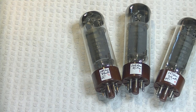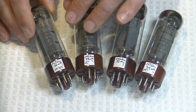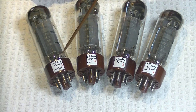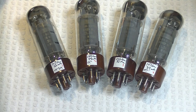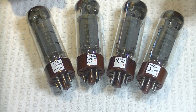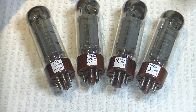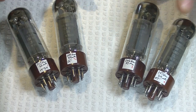Okay, let's look at a quad of really lovely EL-34s — some of my favorites. These are original, not reissue, original Svetlanas. I've numbered them V1, V2, V3, V4 — that's the position they go in the amp. If somebody buys this quad, it's easy for them to see: start at one end of the amp — this would be the left channel — one, two, three, four would be the right channel. It's easy to think of quads as four tubes matched, but when you're testing power tubes especially, I think in terms of pairs. I would start off by matching pairs, then I'd have perhaps a dozen pairs, and then match the pairs to make a full quad.